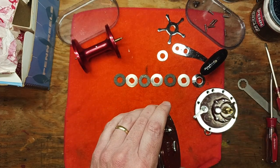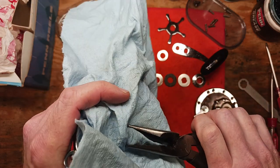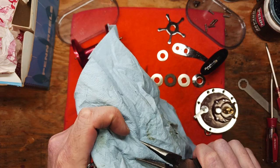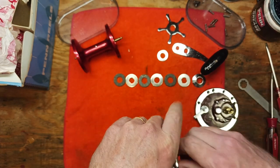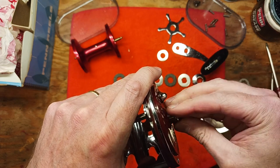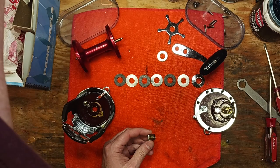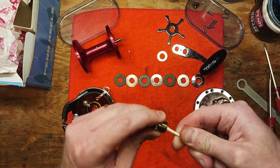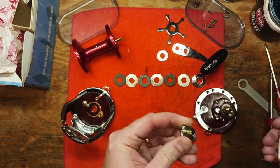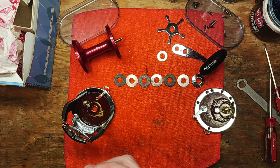This actually does not want to free up that easily — another reason why you do maintenance. I'm putting paper towel on top so I don't mar it up, and gently turning it with pliers just to free it up a little. It was on there pretty tight. I'd go to the extent of taking this out and doing a quick inspection. Let's spray some penetrating oil in there and let that work in to get all the old grease out. I find it helpful to take a brass wire brush to these threads to clean them out.